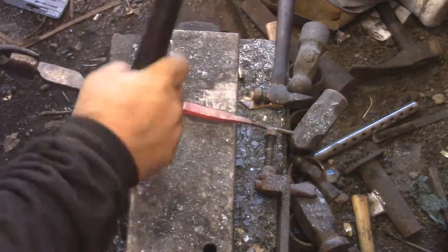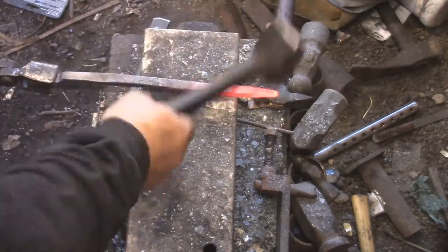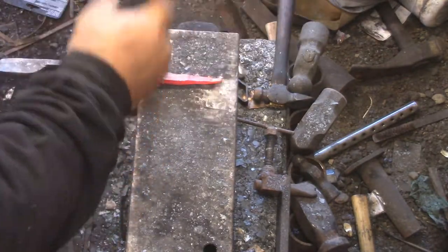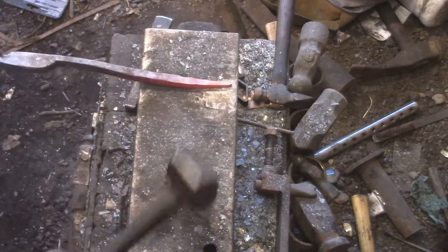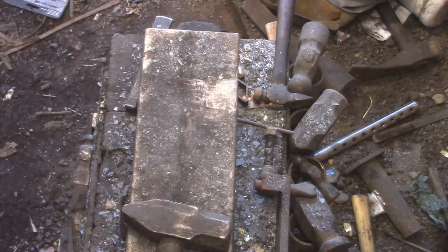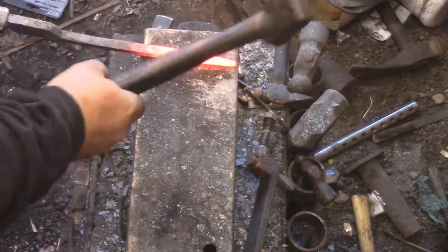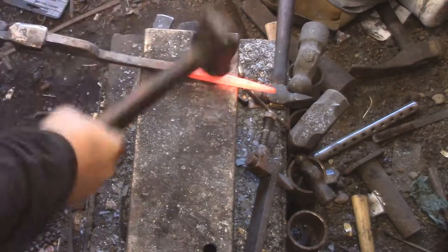And of course, by cheating a little bit, which I think everybody has at some point, you're not limited to just one particular size. You can cheat a little higher or a little lower. Like I said, it's been a week. I did use this pair yesterday and today. Think about it, you can throw sheet metal in there. The first jaw is set for about a 1/4-inch thick stock, but it'll hold sheet metal just fine. Or anything like 1/8 inch, it'll hold fine. So basically we're going from sheet metal to 1/4 inch in the first hole. And in the second hole, of course you can cheat up and down a little bit too.